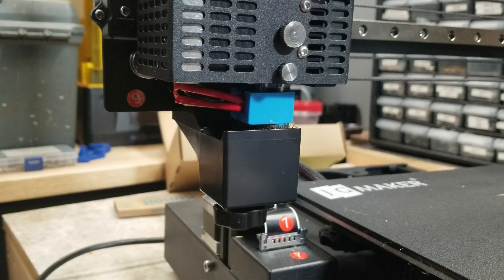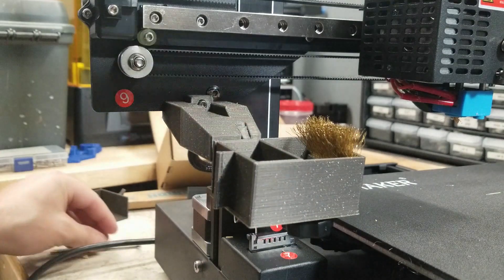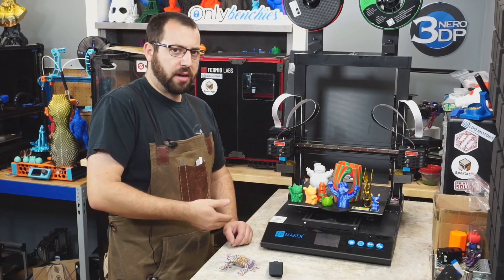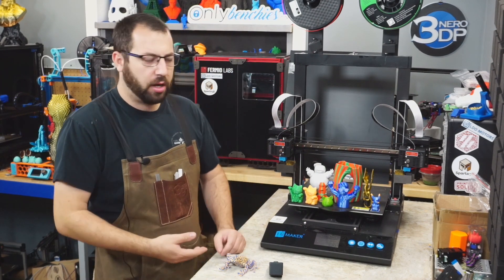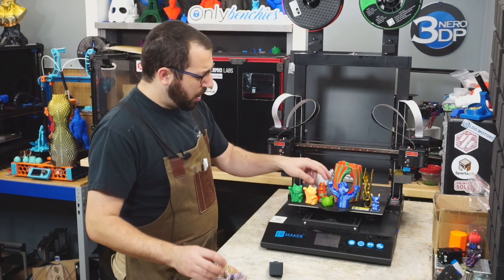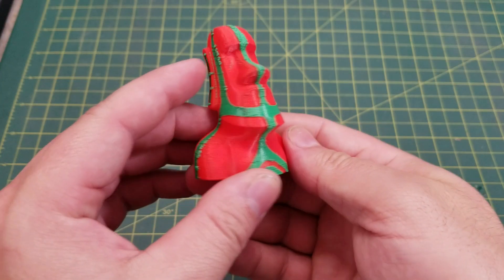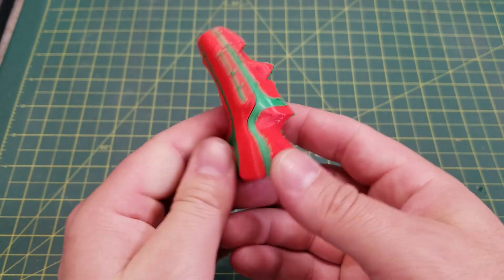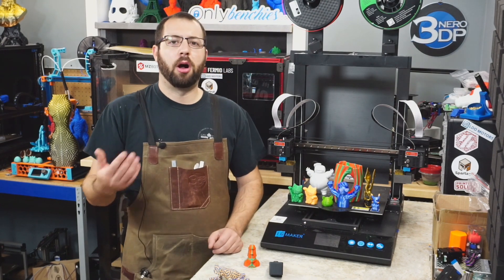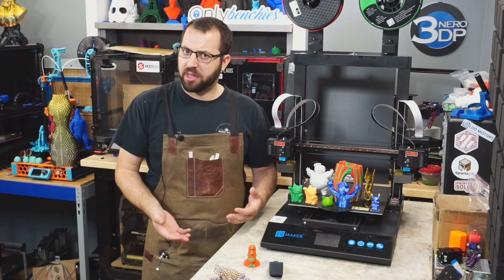Since it's a 3D printer and I have multiple printers, I printed a solution: I found a different drool bucket and brush assembly on Thingiverse and attached it to the printer. This works much better — it gives the brush a chance to actually scrape off the filament before the tool head moves into the print zone, and has a removable bucket to collect the ooze. Normally I'd review a printer as-is out of the box, but this was actively impeding successful multi-color prints and it's an easy two-screw swap. I kept running into issues with PrusaSlicer and SuperSlicer — lots of stringing and oozing, and any small single-color detail would under-extrude — so on the suggestion of JG Maker and another user on Twitter, I switched over to IdeaMaker, which is when I started getting more successful dual-color prints.